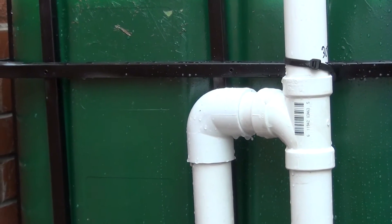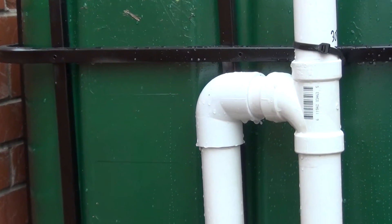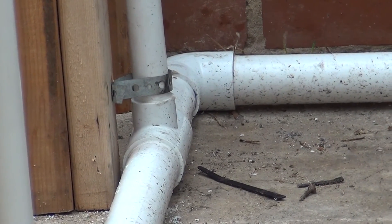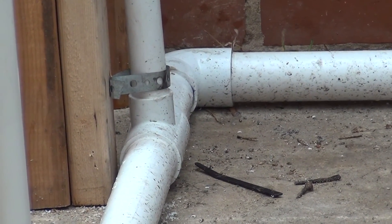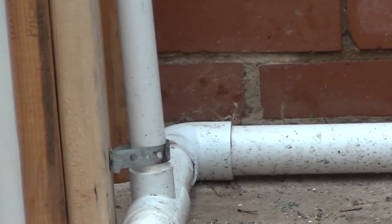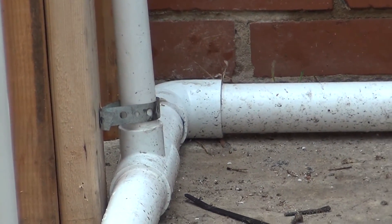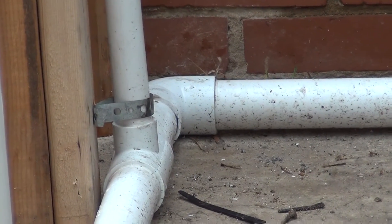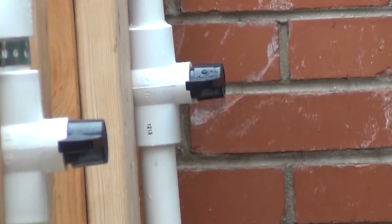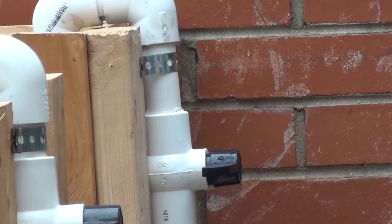That is a head height of 45 inches right there, which goes back to that 90 all the way back down. Repositioned — like I said, it wraps around right there on the floor. Got two more 90s. Once again, people, inch-and-a-half pipe. And I got it going to a T to an inch pipe on each grow bed to shutoff valves as well, so I can adjust the flow coming through. Then right over into the grow bed.